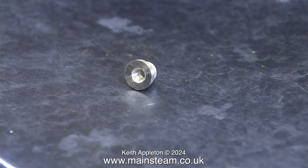Here's my freshly made phosphor bronze bush sat on the bench — quarter by 40 threads per inch on the outside, and three-sixteenths by 40 in the middle. I didn't really need to thread the outside part, but I thought it would be a good idea to make the outer part screw into the boiler shell, so if ever the soft solder failed under heat and pressure, the boiler bush would not blow out of the boiler.